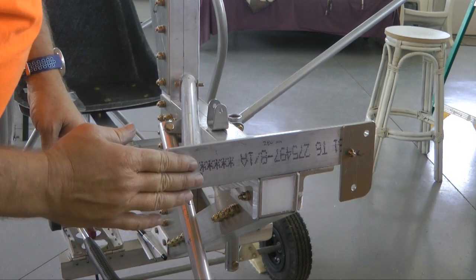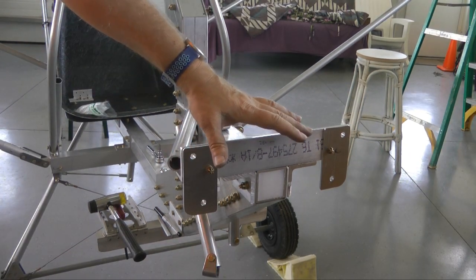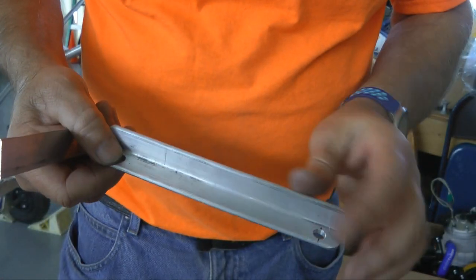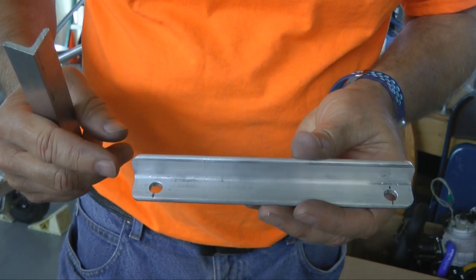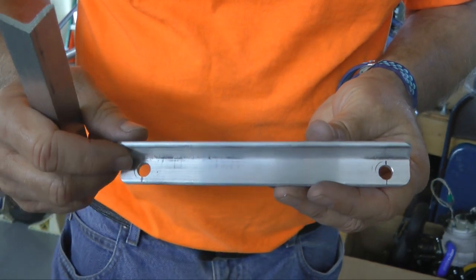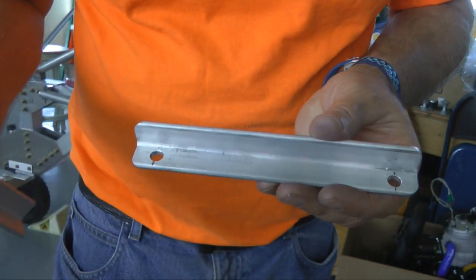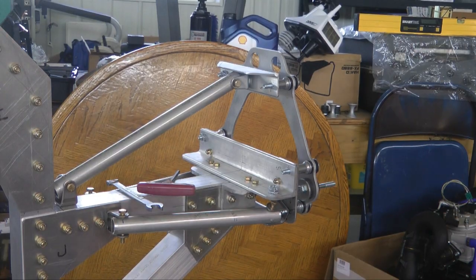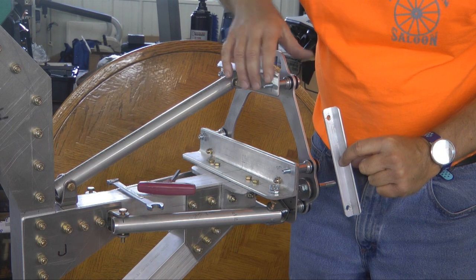We have the other plate that goes right here, and now we can attach the ring. We need to make two of these angles — 3/4" by 3/4" by 1/8". I have two 5/16" holes drilled 139 millimeters apart; that number was derived from the Polini ring mount. Basically we're going to take one of these, cut it off at six and a half inches, drill it with two holes, and round off the corners. These angles are going to reinforce between two of the mounting positions.